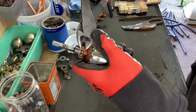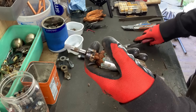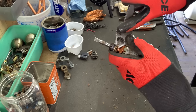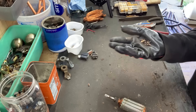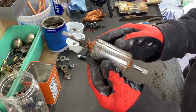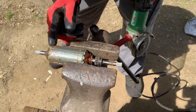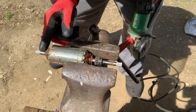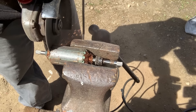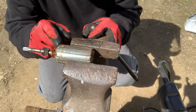When you're doing that, just rest your handle on the bench and push down instead of squeezing — your wrist will thank you. So now we need to pull this out. Sometimes you don't need to put it in the vise, and this one looks like — oh yeah, easy peasy. But sometimes they're stiff, so just clamp it in the vise like that and then just pry it out. Well, it appears that this one is a little bit more stubborn, so we're going to go to the vise after all. And there we go — we decided to take the paper with it.